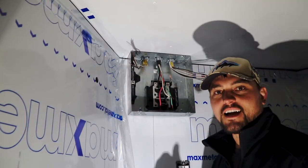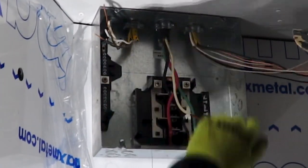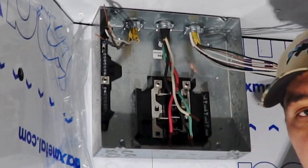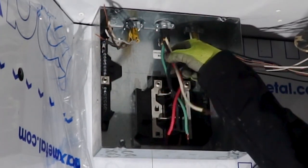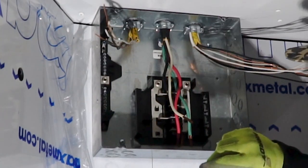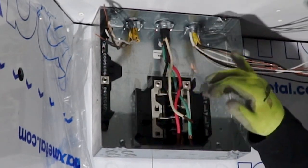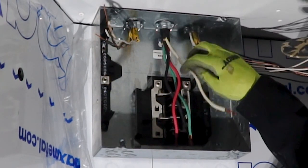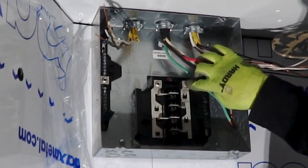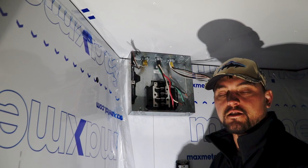Okay guys, we made it - we're finally at the breaker box. I've got it mounted up here and my lines coming through the ceiling. My main service cord is coming through the ceiling, running through the wall, and out to our inlet that we wired up earlier. First we're going to connect the neutral to the neutral bar over here. I need to run to Lowe's and get a ground bar - I thought the box came with one but it didn't - since I have five lines coming in to connect my grounds to. Then we'll connect our red and black hot lines to the main lugs to service the breakers.